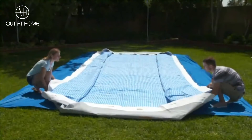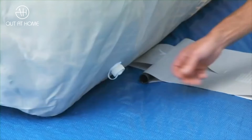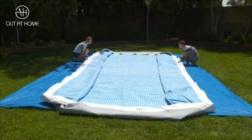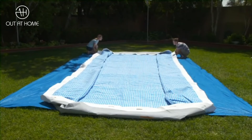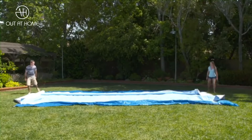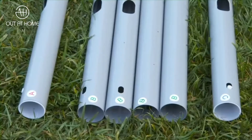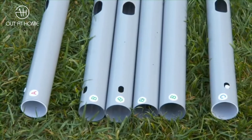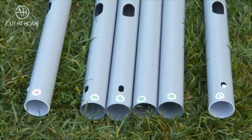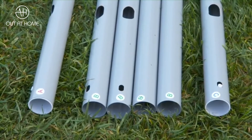Water inlet and outlet holes will be on the side of the pool where the filter pump will be placed. Close the drain valve from inside and outside. Place the beams and smaller parts on each side of the pool. Assembly will be with the liner flat on the ground. Let the sun warm up the liner for easier insertion of the beams. Each long side of the 5.49 meter pool uses one beam labeled A, two beams labeled B, and one beam labeled C.